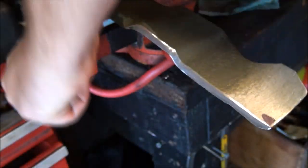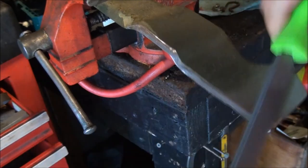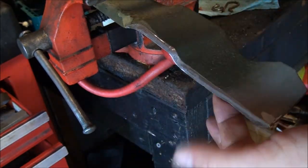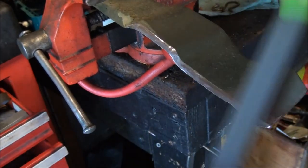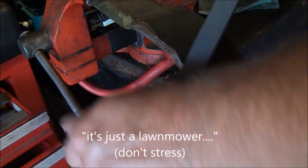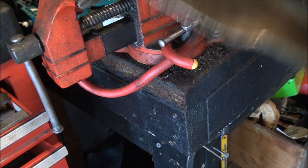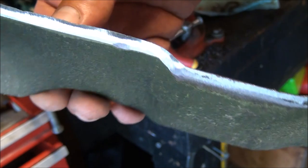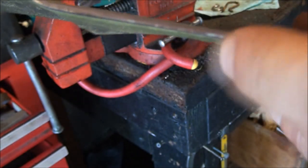We did take off quite a bit of material on this blade, so it will need to be balanced. Basically, with the grinder you rough the blade down somewhat sharp, and then with the hand file you can finish that edge off as sharp as you want. But keep in mind, it's just a lawnmower. I'm pretty happy with how these edges came out. You can see there are still some signs of where a chip was, but this blade is sharp.